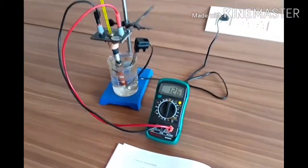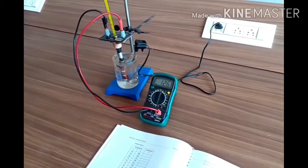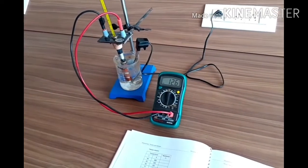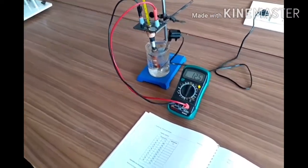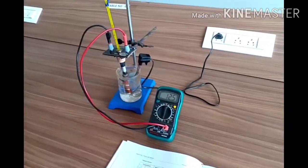You may ask the question: we are heating the copper coil and then cooling it, and while cooling we are taking the readings — why not while heating? We would have taken the readings of resistance while heating itself. The answer is because while heating, the temperature will not be uniform.